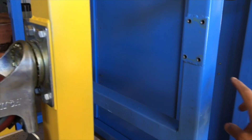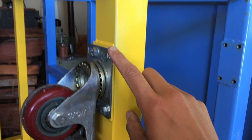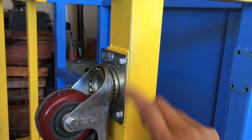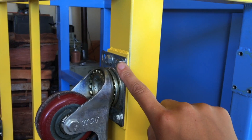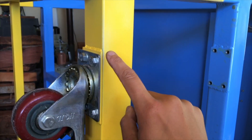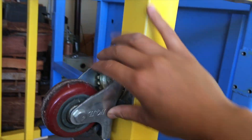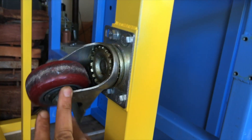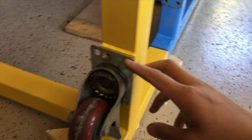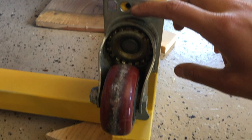Just like with the original frame, I welded on an extra piece of eighth-inch steel here to hold the threads for these bolts. I thought I was being really smart by drilling all these plates at once by basing the whole pattern off of this one caster, but little did I know the whole pattern on the other ones are quite a bit different, so you can see that hole is going to take quite a bit of work to align.